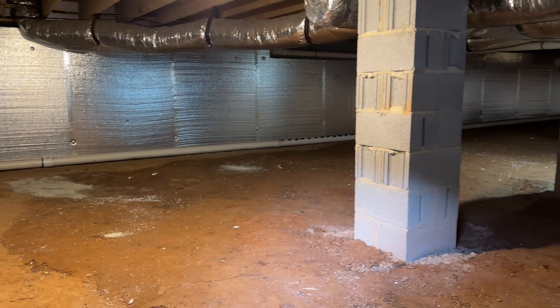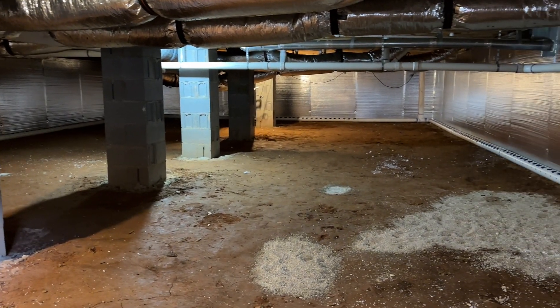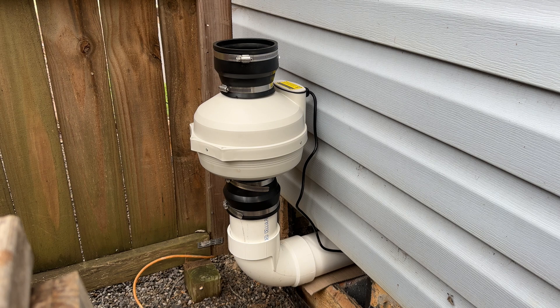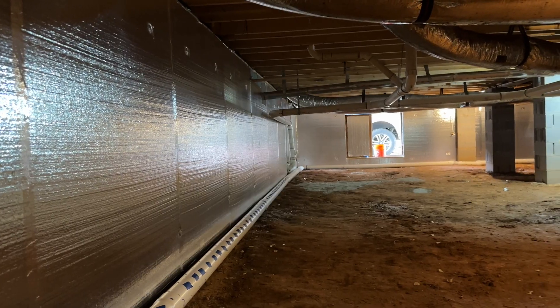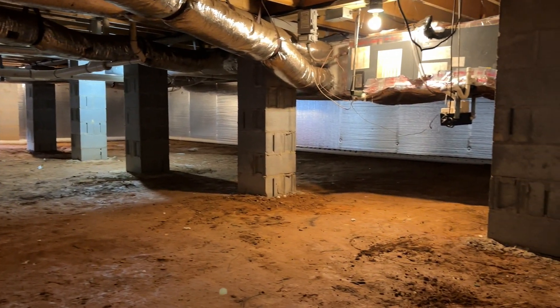It's important to note that all of the fittings and pipe after the T are schedule 40 PVC — use the heaviest-duty PVC possible when installing a radon system. The perimeter pipe is schedule 20 drain pipe, but since it won't be moved that's fine. I also filled the low spot with kitty litter. This shot was me testing the radon fan hooked up to that perimeter system — ultimately the perimeter will be covered by the vapor barrier and the fan will draw pressure underneath to exhaust radon outside. I noticed the system wasn't pulling evenly from the farthest point, so I used painter's tape to cover some of the holes in the pipes closest to the fan, which helped distribute suction evenly.